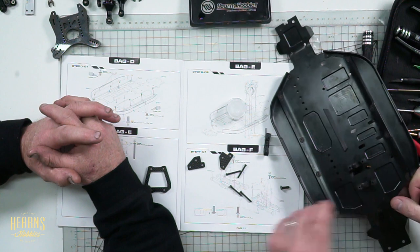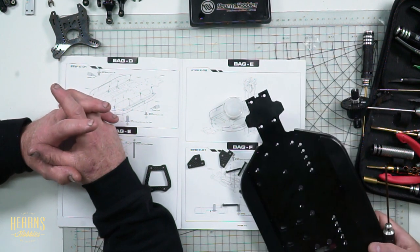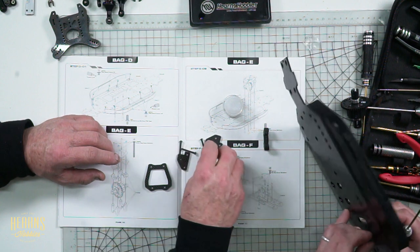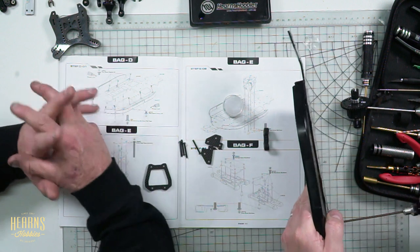And see how these screws are just going in, like one... Obviously, cutting the thread is just key. That way, the screw's not pulling the thread. What happens is if you don't cut the thread, it gets hot, the friction builds, it pulls the plastic, wrecks the thread, and it all locks up or strips.